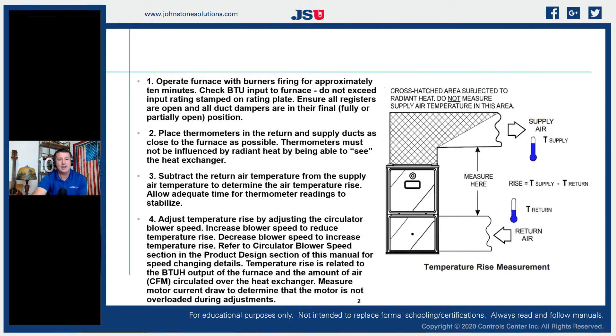It's very much a factor of how much airflow we're moving across the heat exchanger. If we think about heat load — it is BTUs over a period of time — if I change the BTU capacity of my appliance by adjusting manifold pressure, I've now affected the total BTU capacity versus time and changed the heat capability of the appliance. So we always start with manifold pressures, get those in parameter, and then make adjustments in airflow to control our temperature range.